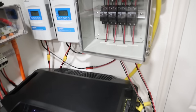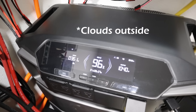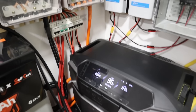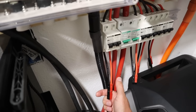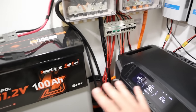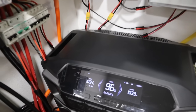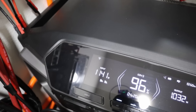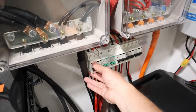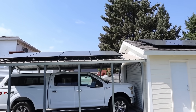Just to show you how that works — let's say the sun goes down, I'll unplug the low PV input. We're getting around 360 watts of solar with the high PV input. Now I connect the low PV input into the 48 volt battery bank — and now instead of 350 watts we're getting 1140 watts. That's basically a DIY expansion battery for the DPU. You can leave it connected all the time, and shutting it off works as a power switch.